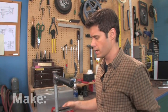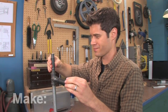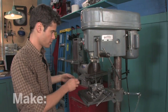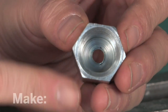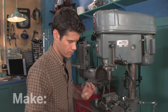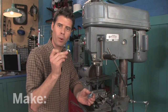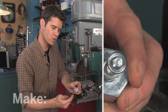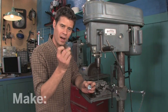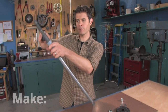And finally, this short piece will go on top, and that's where I'll attach the camera. I've carefully drilled a hole through the end cap. This is where I'm going to put the bolt to attach the camera. Here's one I did earlier. So I've placed the bolt through with a washer, lock washer, and a nut. And now this is the cool part — I'm going to take a wing nut, put it on upside down, and this will allow me to tighten it up to the camera. Finally, I've got this washer that will act as a base. I'm going to add the weight to the bottom, but first let me place a handle on here so I'll be able to rotate the rig.